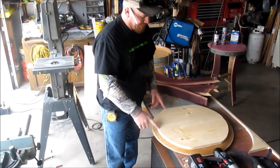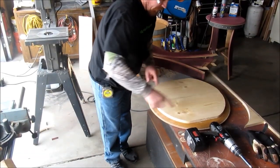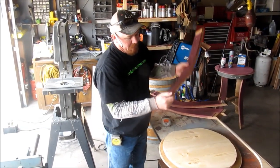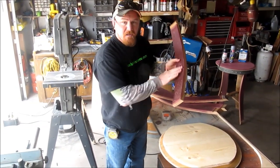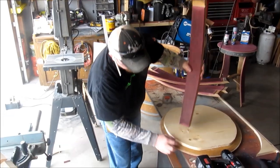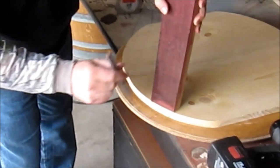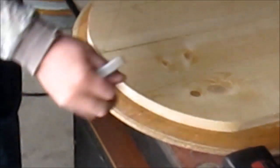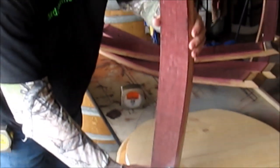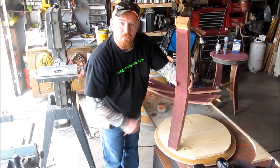I've marked out the curve here — it's 11 inches across, so at five and a half is the center. That's where we're going to want our legs for a nice offset on both sides. Took one of our staves over to the saw and we cut a 10-degree angle on here, with the longer side being towards the red since the red's going to be out. We're going to mate this up right down here on our five and a half inch mark. Eyeball it, lay it down there, mark it out, and then we're going to take that back over to the band saw and cut that piece out, and our leg is going to fit right down in there solid. Do that for all four legs, and then we're going to mount it to our common board, which is mounted to our barrel top.